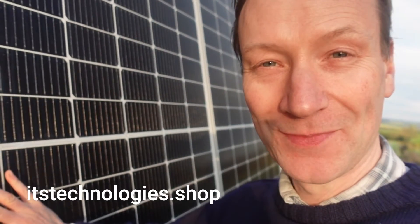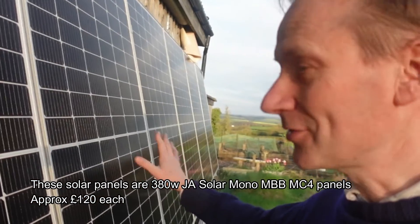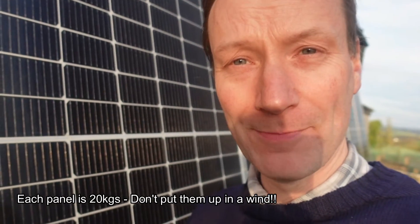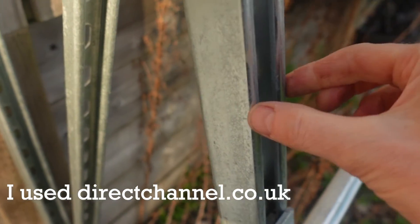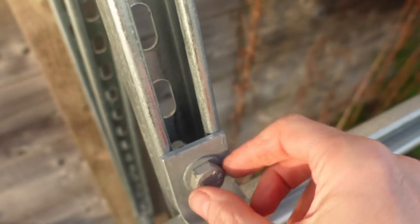So we've got these rather good solar panels — I'll put in the description exactly what company I bought them from. These are 400 watt panels, and I've got six of them all the way across. They're quite big and quite heavy as I found out, so I needed a pretty sturdy frame to mount them on. I used galvanized steel channels — these ones are 40 millimetre square and these ones are 23 by 40 millimetre.